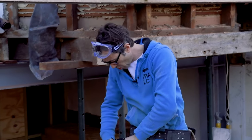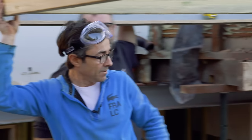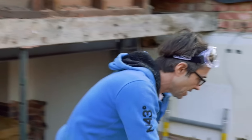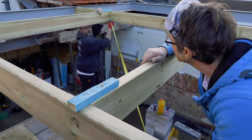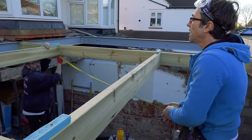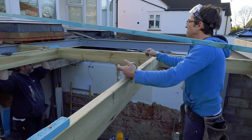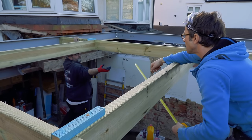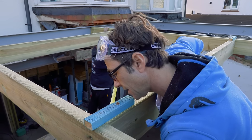Next up: squaring it up, batten across the top, and then we can build everything off it. I'm going to take a diagonal measurement — this has got a difference of 15mm, so I've measured my two long diagonals and I'm going to make them exactly the same. Then I know I'm exactly 90 degrees to my wall and the roof lanterns will fit a treat. We need to increase this length and decrease that length — so we just knock the joists over, go five mil in the steel, and get it spot on.